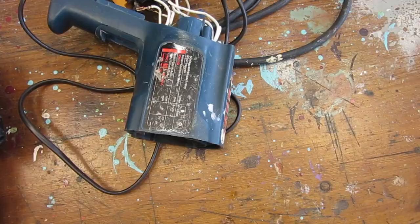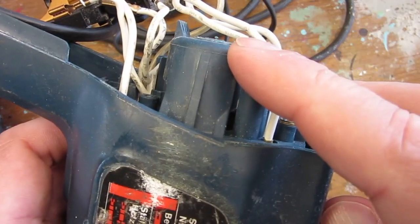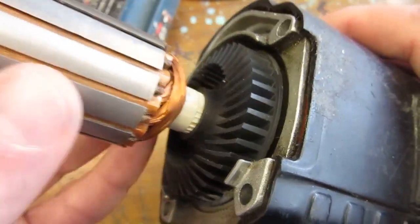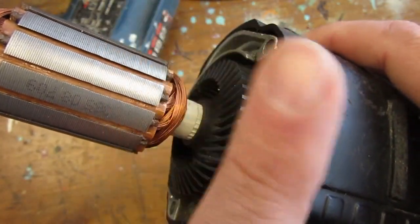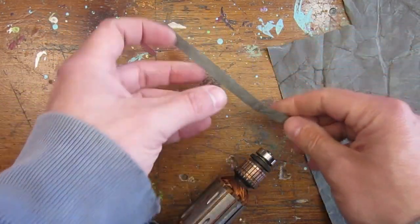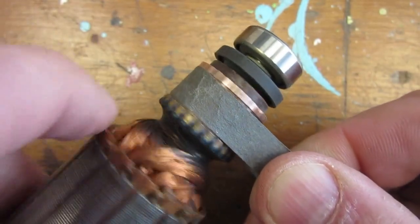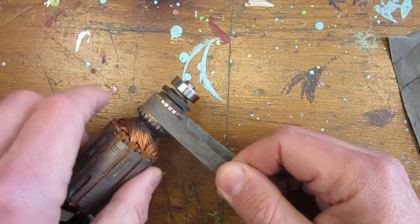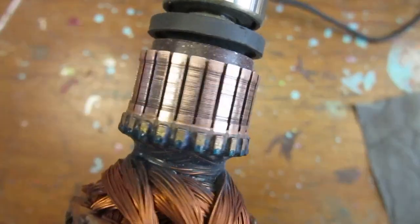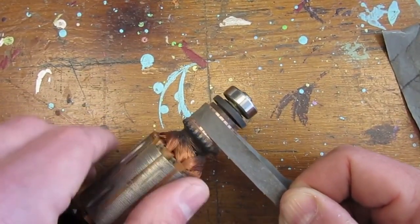At this stage I have to improvise. I cannot polish the commutator with the commutator cleaning stick while the motor is running since the plastic housing is in the way. I also do not want to take the armature out of its gearbox to place it in a drill or a lathe, so I have to go the route of manual polish. This is also a bummer since I only have silicon carbide sandpaper, and I have read somewhere that you should only use aluminium oxide for the job. I'm not sure why that is — maybe that the dust created is more conductive and prone to short the anchor. I will compensate in any case by cleaning the whole thing extra thoroughly.